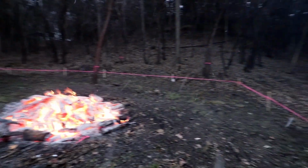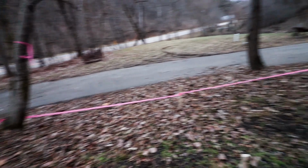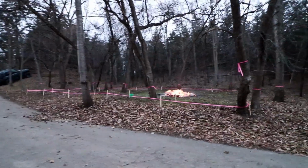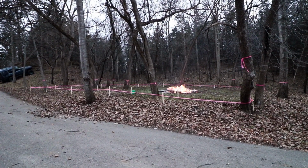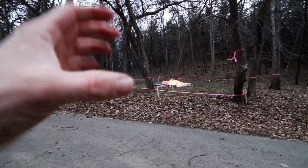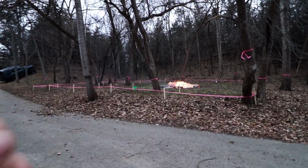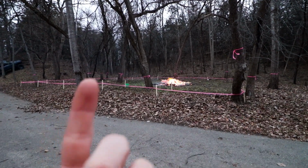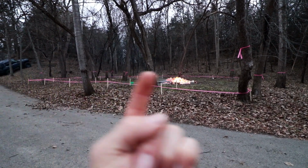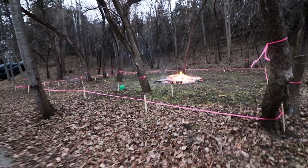What's laid out in pink here is a 36 by 48, which would be a decent size. The only thing I'm running into on this guy that's gonna create some difficulty and expense is the slope on the hill. I would have liked to just do a pole barn and some concrete piers in there, but I think we're gonna have to do a foundation wall all the way around and dig this down in the back corner from there around. It'll have to be walled up, so we'll probably end up having to stick build this guy, but we shall see.